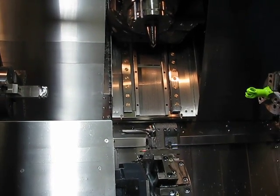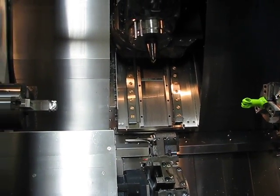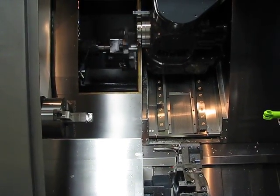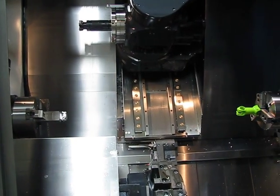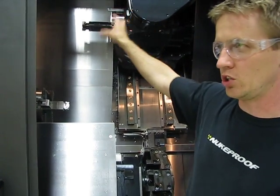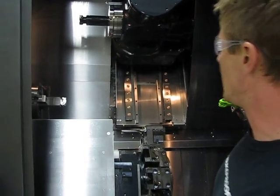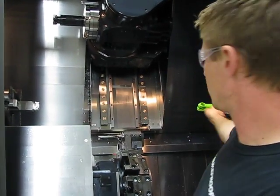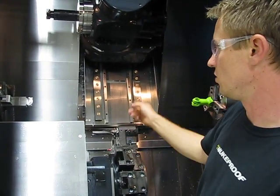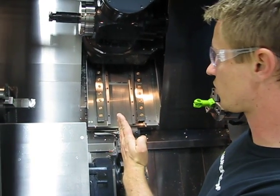Now we might be able to follow that tool. The first tool is a lathe tool. Now we have a milling tool that can spin up to 12,000 RPM. There are up to 40 tools in the back magazine where that door opens — a carousel with approximately 40 tools. You can have lathe tools or milling tools. So you can do milling or lathe work on either spindle at any angle with the upper head.